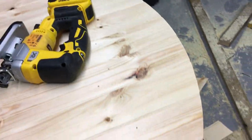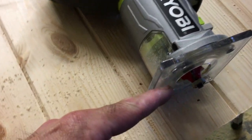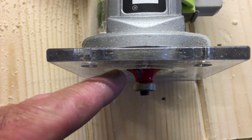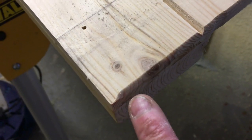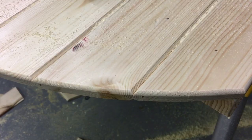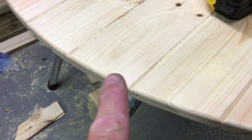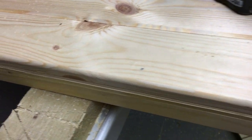There's a nice curve at the top of the gate. I've got a little trim router now with a round-over bit in it. If I run this right around the gate it's going to round over the edges — I've done a small bit here at the bottom so you can see the difference: that's where I've run it along. I'll run right around the whole gate. So we've been around the whole gate with the round-over bit — as you can see, as opposed to the sharp edge we've got a nice rounded edge there.